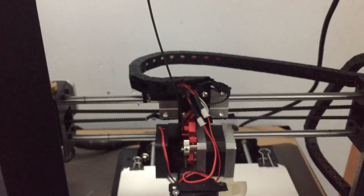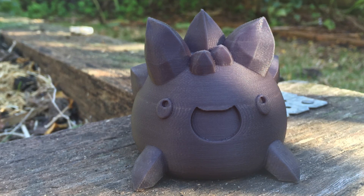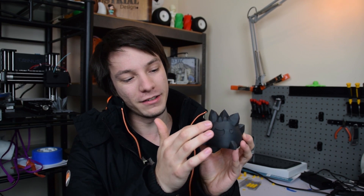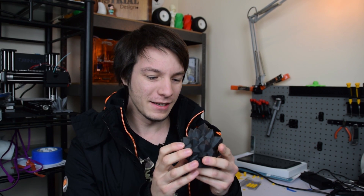Next I tried the thermochromatic, or color-changing, plastic. It changes color with temperature. It's advertised as PLA that changes from gray to white, which didn't sound that interesting at first — but I was wrong. This is Garrett's Rock Slime model from Chaos Core Tech. Printed completely hollow with three shells in Simplify 3D and three bottom and top layers, it looks phenomenal. It's 200 micron layer height on the Cocoon Create and it is freaking adorable. Print quality is really good — no drooping or missing extrusion lines. There is one faint line going across from the top of the mouth through the eye area, but that's the only thing I can pick up on.